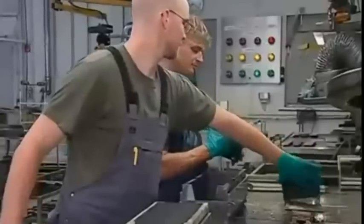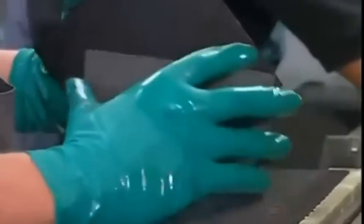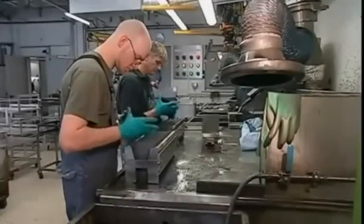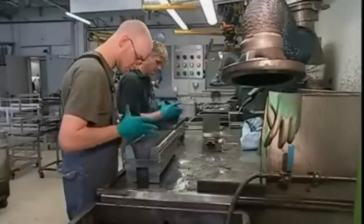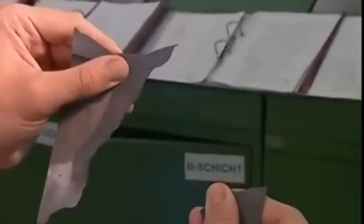The slices must be separated to be cleaned, but no machine exists that's sensitive enough to do it without breaking them. It must be done by hand because the panels are barely fingernail width and incredibly fragile. Wherever humans are part of a process, contamination follows, because we release millions of dust particles. The freshly cut slices must now be thoroughly washed before they can be treated with the second chemical.